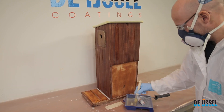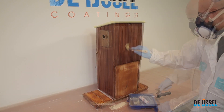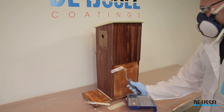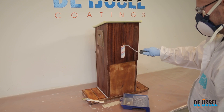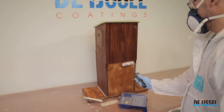After 24 hours curing at 20 degrees Celsius, the surface must be sanded with grit paper P120 before a next coat of VarioPox roll coating, VarioPox Universal Resin or Amopox HP coating is applied. After 48 hours curing at 20 degrees Celsius, sanding with P180 and degreasing with double coat degreaser, a first coat of double coat may be applied.